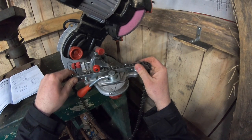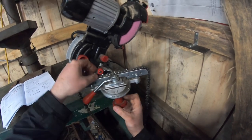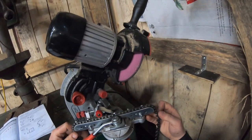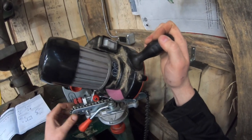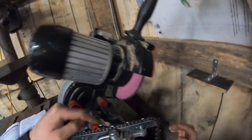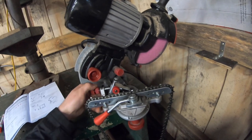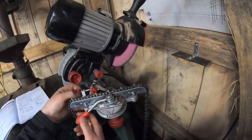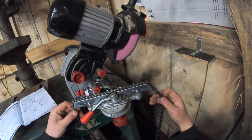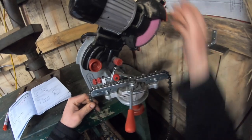To sharpen the other side, loosen the vice rotate — now this arrow goes left of zero to 25 instead of right. This time I pull the chain forward to get that 10-degree tilt and clamp it down firmly. Now I'm sharpening all the opposing teeth. Repeat the same process: make sure the arm is centered, adjust the chain position with the two knobs, lock it in, and grind — skip — grind — skip.